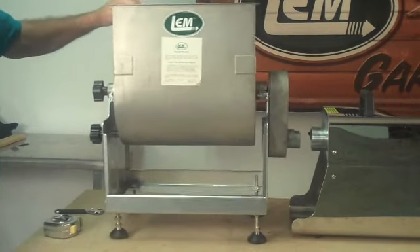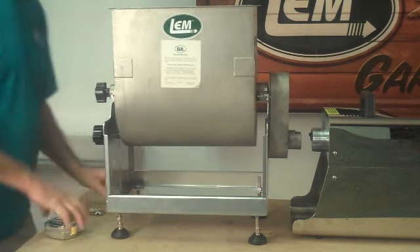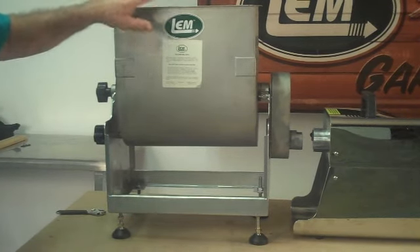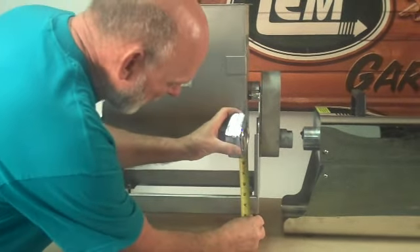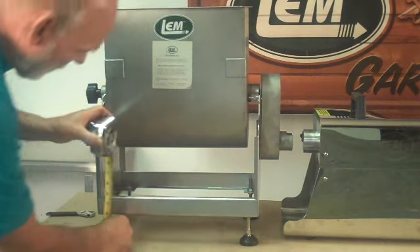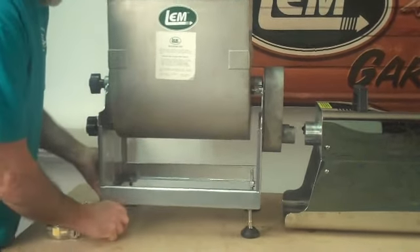You can see I'm still kind of wobbly here, so I'm not at the right height yet. The best way to do this is not to try to level it, because chances are your table or floor isn't level. The best way is to take a measurement — on this particular unit, four and three-quarter inches is going to be the magic number. So if we've got four and three-quarter here, we have to get four and three-quarter there, and right now we're at four and a half. So this has to come up another quarter of an inch.